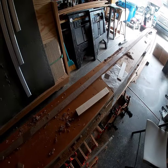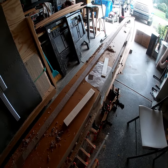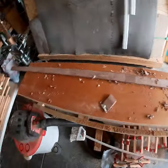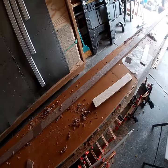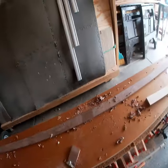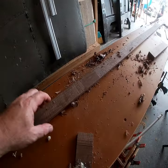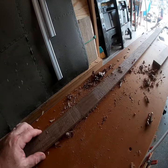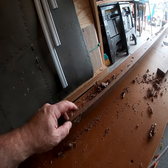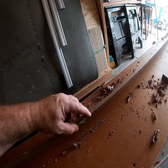So I have probably made as many mistakes as one can possibly make. This walnut strip along the bench had to be scarfed together from, I think, four different pieces. When I did the scarf, I cut them at an 8-to-1 ratio, which I think is pretty standard. Here's one of the scarves — I used a polyurethane glue, which I probably won't use again. You can see it's that long of a scarf — it would be 8 inches long to 1 inch thick.